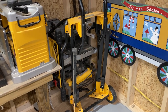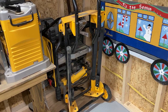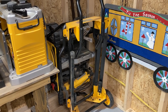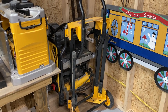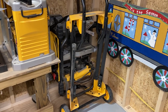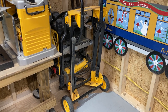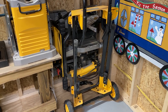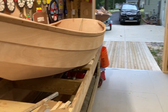What we wanted to do first was cut the gunnels — cut the little strip. We made it 3/8 inches wide, and in addition to the plank, gave us a total of one inch. Could have gone a little thicker, but it was our guesstimate that that would be plenty thick. We cut that with our little DeWalt table saw on its stand — rolled it outside, set it up, marked the mahogany, ripped 3/8 inch strips off of it.